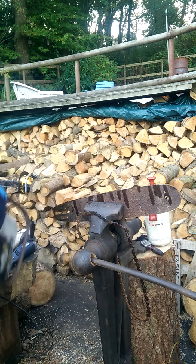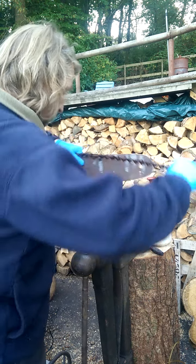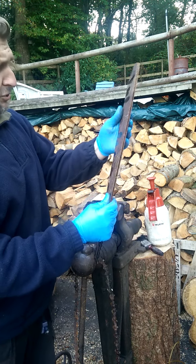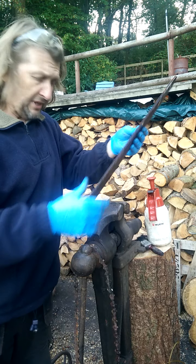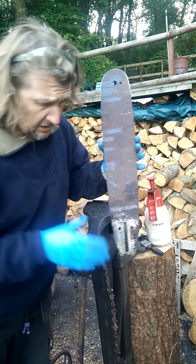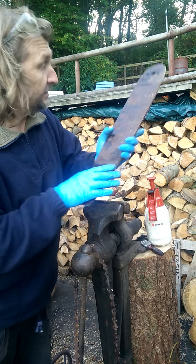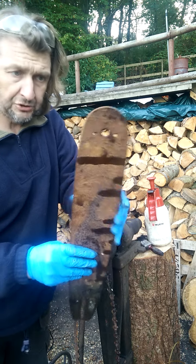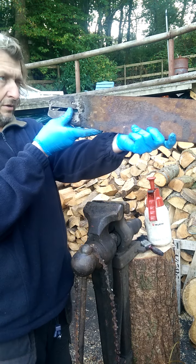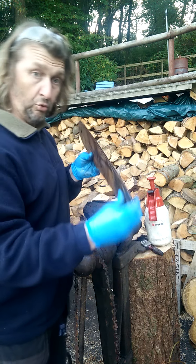She's free - engine off. Here she is then - they're a gorgeous profile, absolutely beautiful. So if this is around 1957, it makes it about 63 years old. You can see where she's been clamped - the oil in the sawdust at the motor end has been her friend. The hardened stellite tip has got excellent symmetry, and the rest - well, it looks heavily pitted. The drive rails themselves, we'll come on to that - they've got a little bit of deviation in them. There's a slight bend in the bar. All those things we'll get to now.